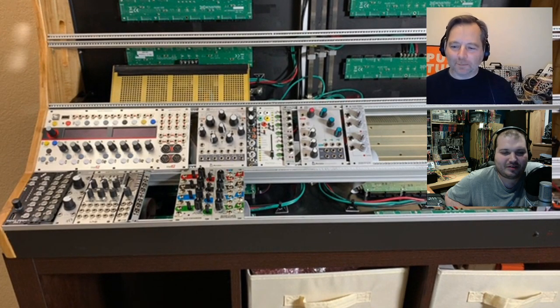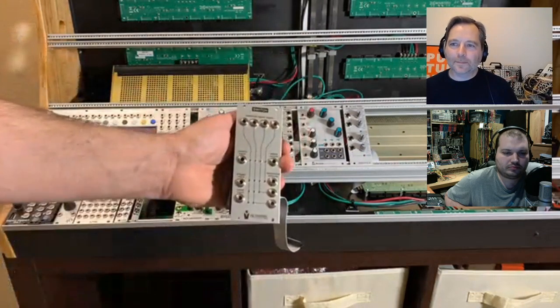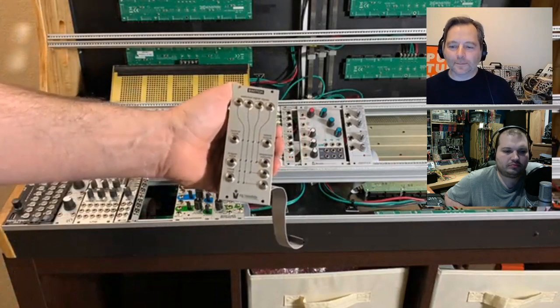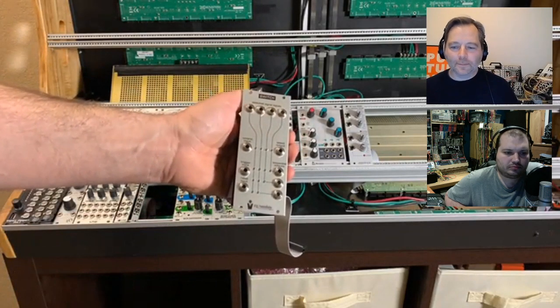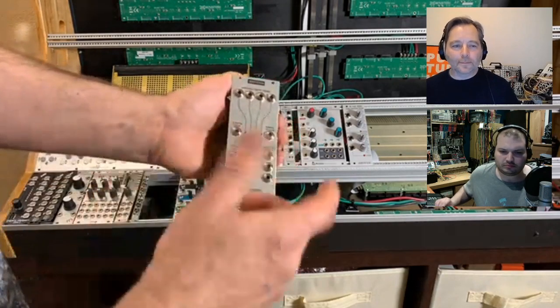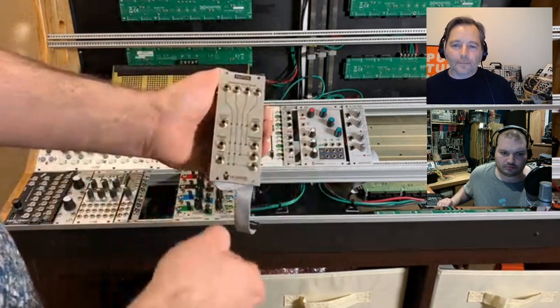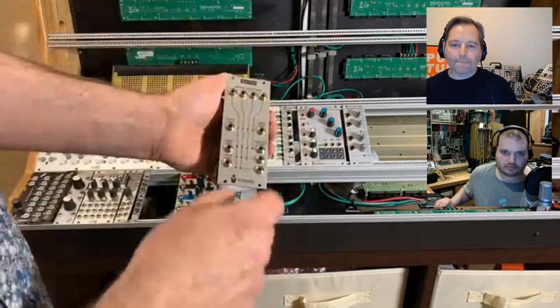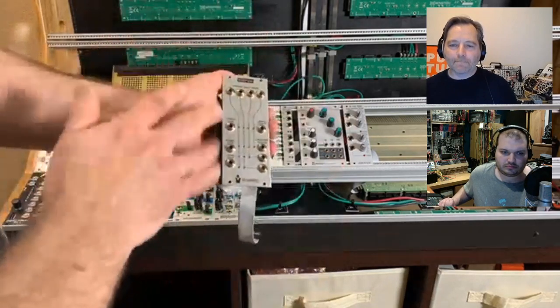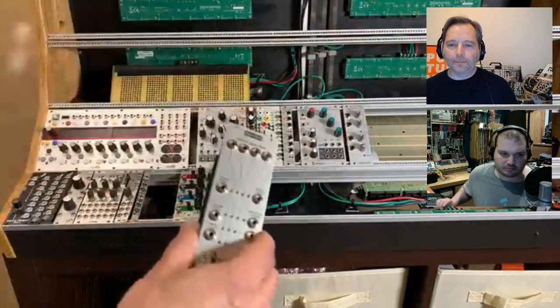We'll see. I'm just looking at where I cross over my center line here. And when I start plugging to the other bus boards, I got plenty of room. So the one other thing I'm going to put down this row is I do also like having sequential switches. It used to be the way we used to have to patch ratcheting. Now a lot of sequencers have it built in. But it's also fun to do all sorts of hocketing tricks where you alternate a gate between two different channels or more than that for different instruments, simulate up pick, down pick, simulate left and right bongos. I just love having a switch in my system that allows me to take a gate and then spread it between other outputs.